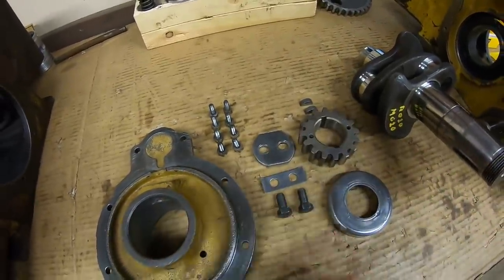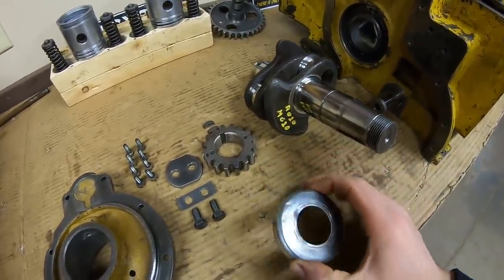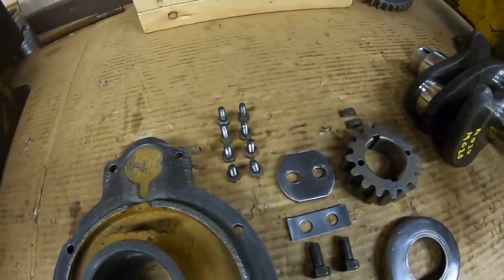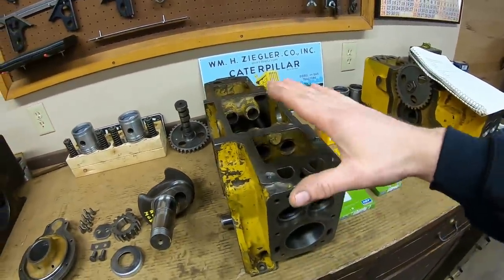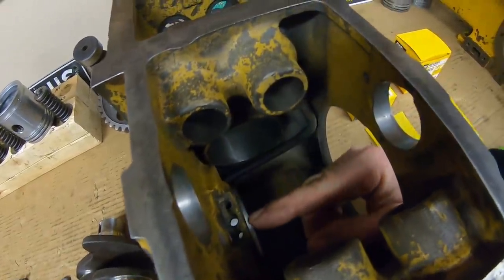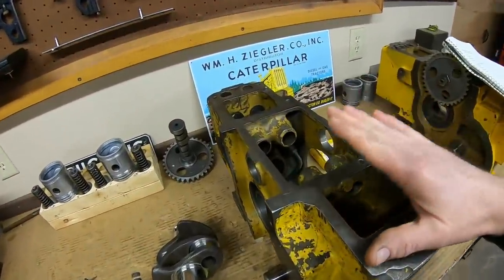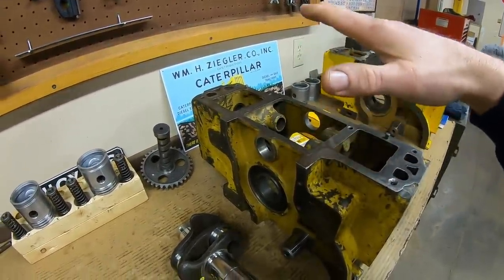Over here, the rest of the pieces we're going to use today. We have the crankshaft sprocket, the Woodruff keys, and what Cat calls a washer — it's the sealing surface for the front main seal. Then we have the heavy washer, the fold-over lock, and the two bolts that secure the sprocket to the crankshaft. And the rear cover with bolts. This is going to be the easiest crank install of the three blocks because this one is in the best shape — good bearing bore, good dowel hole, never been hogged out, and a good web that's not cracked. As we go down the line, the others are progressively worse.